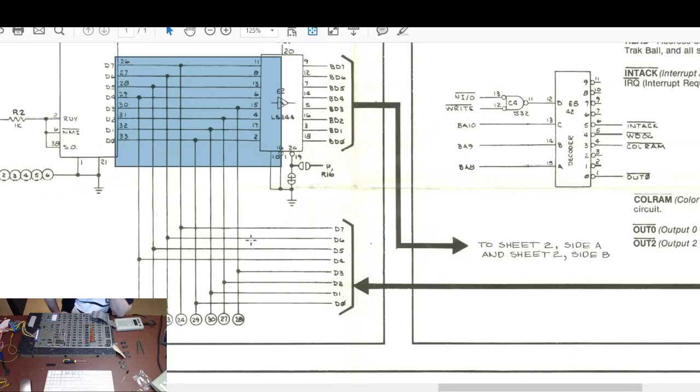And there's no real easy way to figure this out without snipping every leg, so I might as well actually desolder them. If it's saying that two of the pins are tied intermittently, it's either muck underneath it or something like that. I'm going to pop the CPU back out of its socket. It does seem to be trying to run the code, so something must be working. Let's take that out.